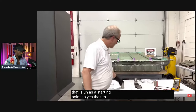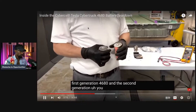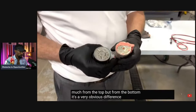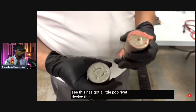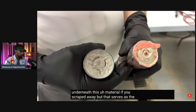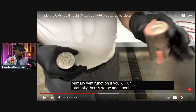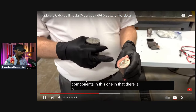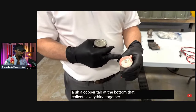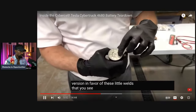The fundamental differences between the first generation 4680 and the second generation are pretty clear. You can't really tell much from the top, but from the bottom it's a very obvious difference. The Gen 1 has a little pop rivet device with a ball bearing underneath the material that serves as the primary vent function. Internally there are additional components — in Gen 1 there's a copper tab at the bottom that collects everything together and makes the electrical connection to the can.